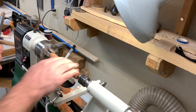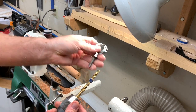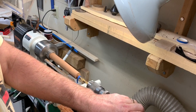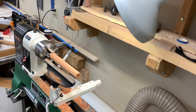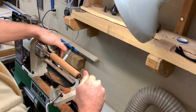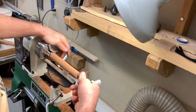Now that I've got it pretty much rounded off, I am going to be drilling the opening for the bottle opener. I get a drill set up — this is an 11/32nds drill bit, and I put a blue piece of tape right there to make sure it was the depth of how deep the opener went in. Line it up, get it into my drill center on the bottom there, drill to the proper depth, and pop it out. Now I'm going to hand-thread on the opener just to make sure it's going to be able to grab and thread itself in, hold nice and tight. It's pretty tough pressing it in, so it's got to go all the way in. It's got a nice tight fit — I don't even think I need to glue these in place. I take a pencil to mark where the outside edge of that metal is, because I want to make sure that the bat's very bottom handle kind of matches up to that pretty close.